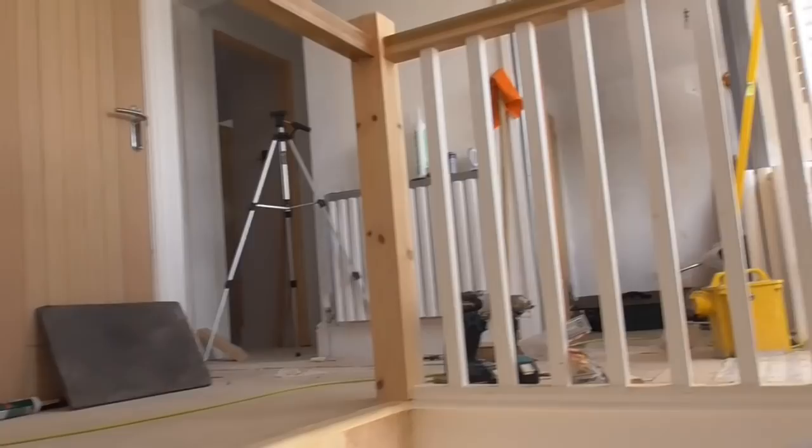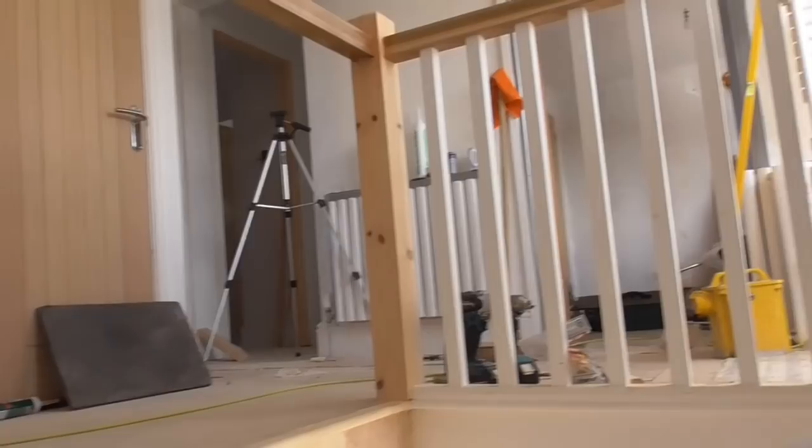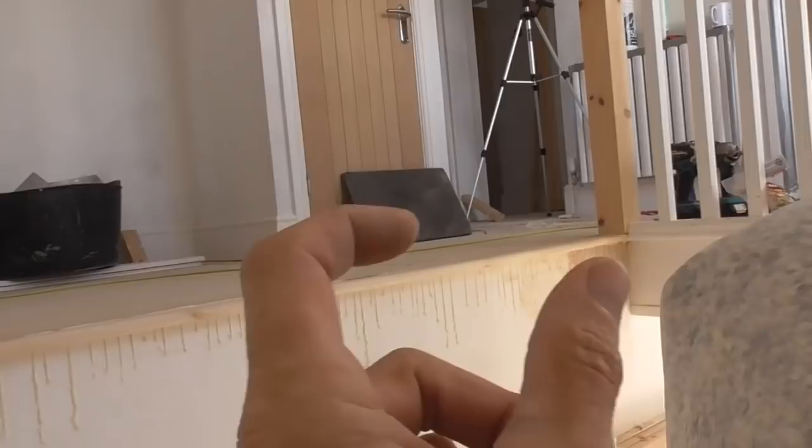What I'll do now is let all that set up a little bit. It's now lunchtime — I'm going to have a sandwich and a cup of tea, and all this stuff's going to clean off nice and easily. We've really broken the back of it now. It's just a case of putting the base rail in and then doing a little bit of maths — working out our spaces so we get a gap no bigger than 100mm for building regs, but also so we don't end up with a funny little gap at the end. I like all my gaps to be even all the way along. I can hear the kettle boiling — I'll come back and get on with this after lunch.